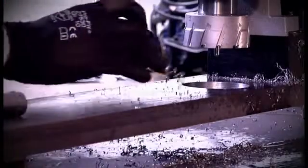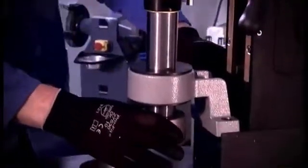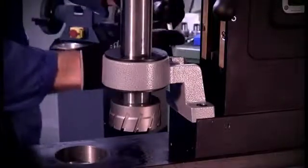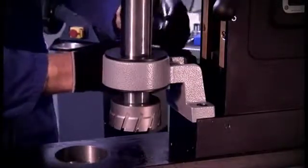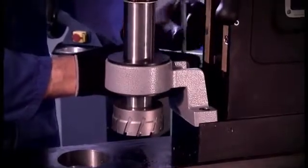After drilling, chips must be removed. For doing so, we recommend using our power worker POW100. But be careful, there is a high risk of injury and you have to wear protective gloves. Also, the drilling core should be treated with caution. The core becomes very hot due to the cutting process.